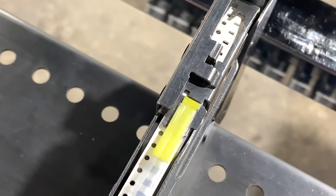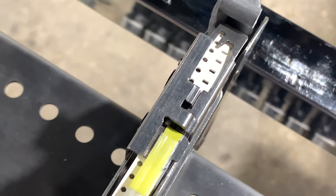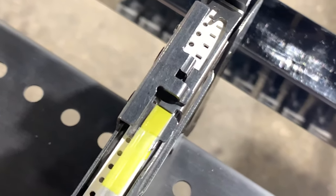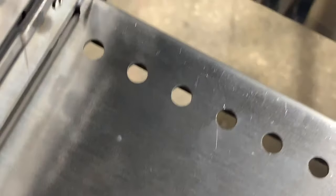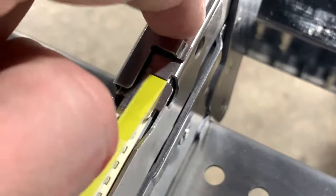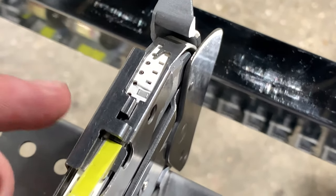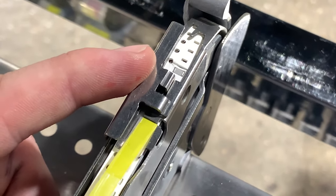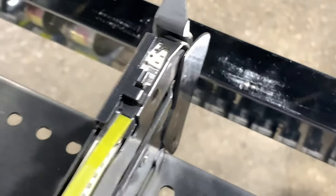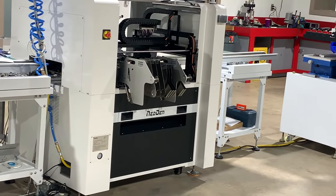Now you're going to want to test and make sure that your tape advances correctly. We're going to press this lever down, which withdraws that piece back — every time you release it, it should advance a full four millimeters. You can see exactly what you want here: this 1206 capacitor is right under this sliding metal piece. When I push this back, that's what happens when your pick-and-place head comes to pick up the part, and as I release it, it advances a new part ready to be picked up. This feeder is now fully set up and we would go install it on our pick-and-place machine.